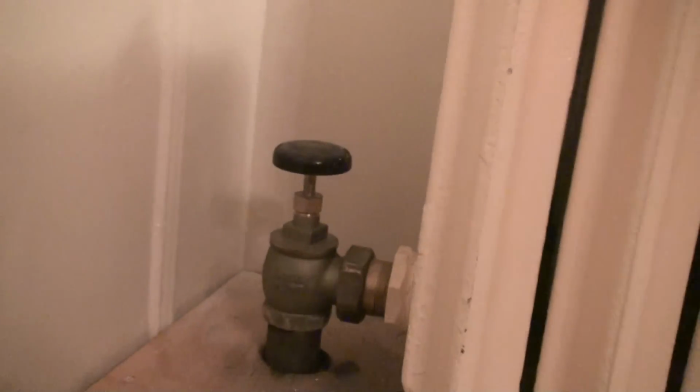So whenever you have a situation like this, where you have end to end, the most effective thing for the steam to do is go straight down. With these sections here, what you're trying to do is force that steam down here and run it through the rest of this, which it's pretty much not going to do. So once again, you're going to have a diagonal slant where a certain part of the radiator gets excessively hot and a good portion of it is barely warm or doesn't heat up at all. That is another bad connection. You cheat yourself out of heat in so many different ways, it's not funny.